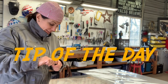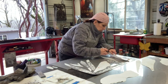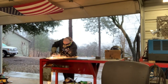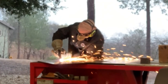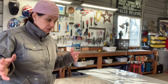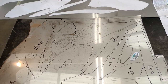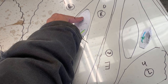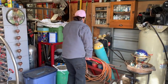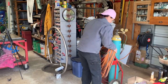Here's my tip of the day: when laying out patterns on metal, there's always going to be some space in between — that's just waste, particularly when you're plasma cutting or hand cutting. There is some waste you have to figure out when you buy your materials. Go through your biggest pieces first, then to save space, fit the small ones in between so you can use every viable piece. That's my tip of the day. Now it's time to break out the oxy-acetylene because we have to anneal the copper I just hammered.